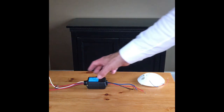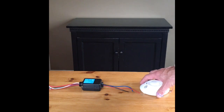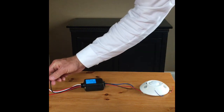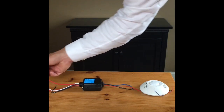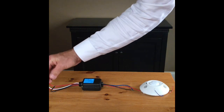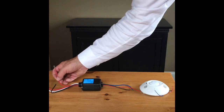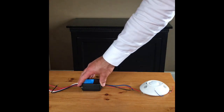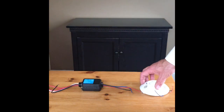Alright, so here are the basic components that we have. We have both our power pack and our motion sensor. Let's look at the power pack first. We have our line voltage in and our neutral, and then if we're actually going to control our lights from this, we bring in one of the red wires connected to the hot — this would be our switch leg out for the power pack. The power pack, in addition to just switching lights on and off, creates low voltage which powers our motion sensor.